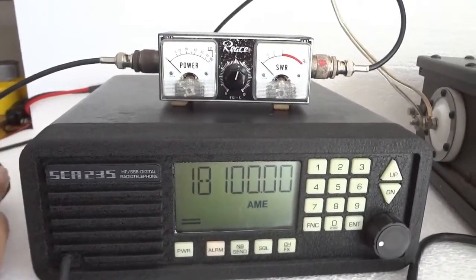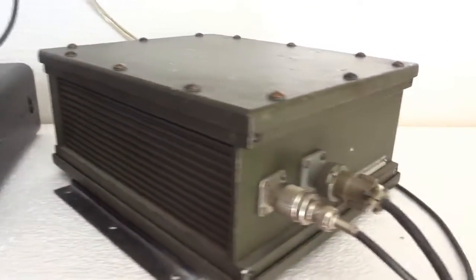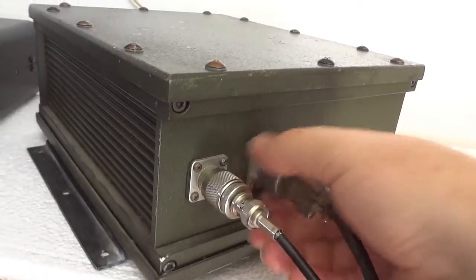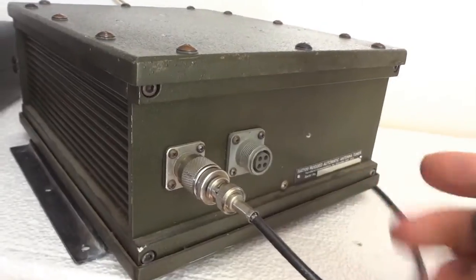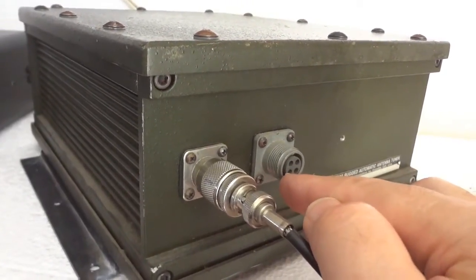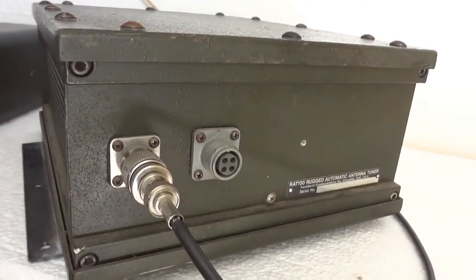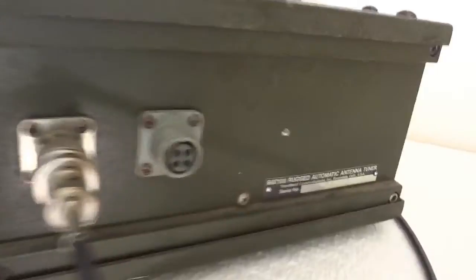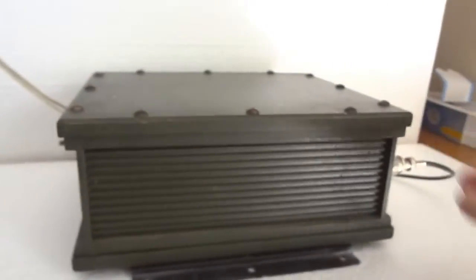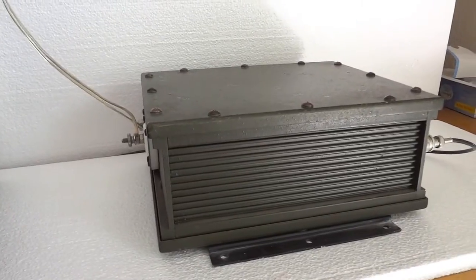As you can see, the RAT100 military antenna tuner is very easy to interface. It works off 12 volts - you just pull down the key line with a button and you're good to go. It comes with the connector. There is ground, positive, key out, and key in. When you activate the key line, the output can be used for transceivers to generate a low carrier level. It's explained in the included manual, which also has all the schematic diagrams. It's a nice, very rugged device and this particular one is in like-new condition. Thank you for watching.